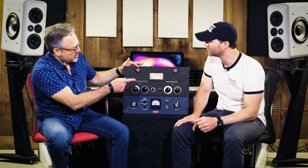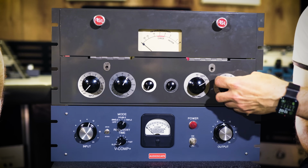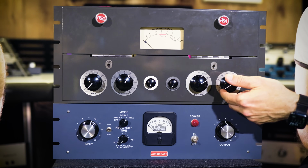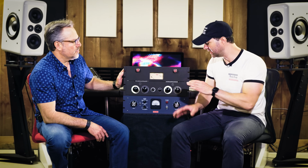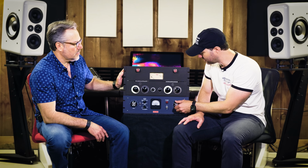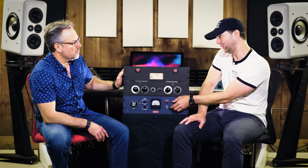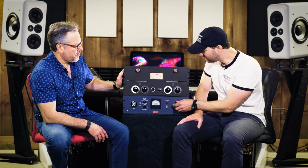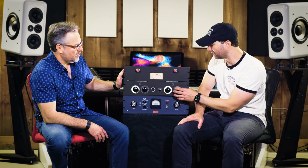Now, if any of our friends are watching, oh, I'm sorry, we have another knob. Oh yeah, just the output control. I was just going to say we did actually. These are gain monsters. The originals, you could just plug a mic into it and go if you wanted to. We did make the gain range more usable, so we did pad it down a little bit on the output. Not crazy, just a couple dB. So you actually can, instead of having the knob right there. And I know this happens even on the Stay-Level. They're notorious for you can't drive the output stage at all. And that's been some of the biggest complaints with some of these older Vari-Mu designs. Once again, built for broadcast. And the gain reacts different with the slower releases they had fixed as well. So having more control of that output range was important from the design perspective.